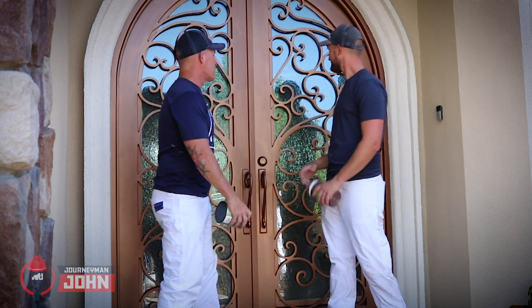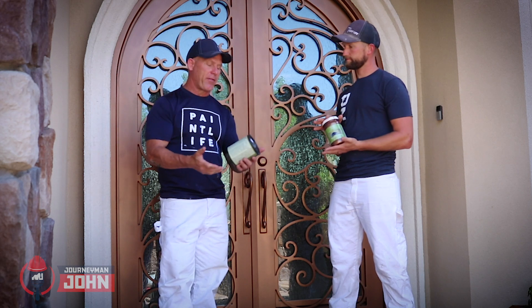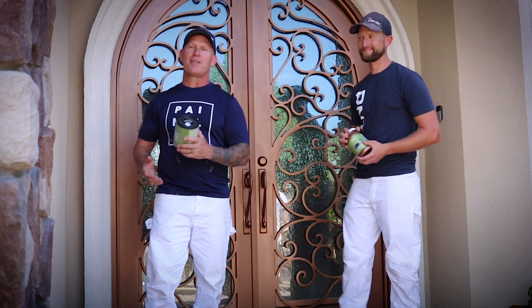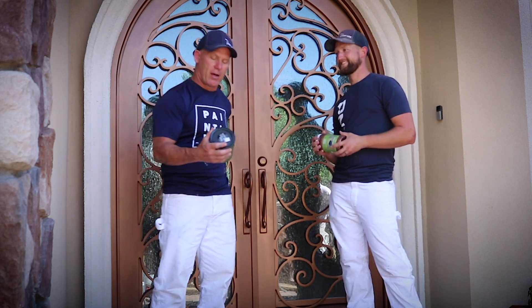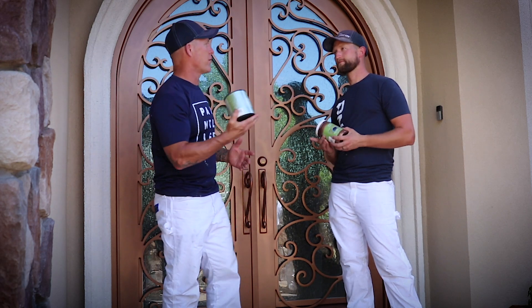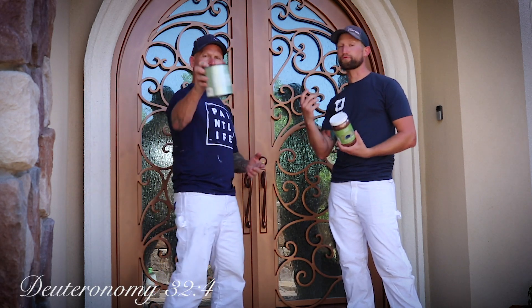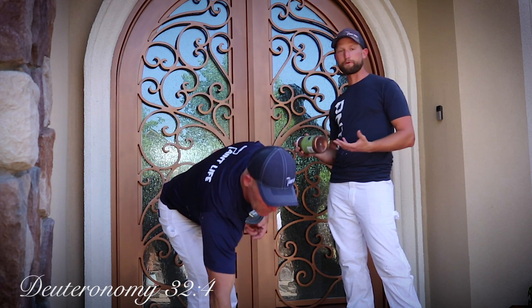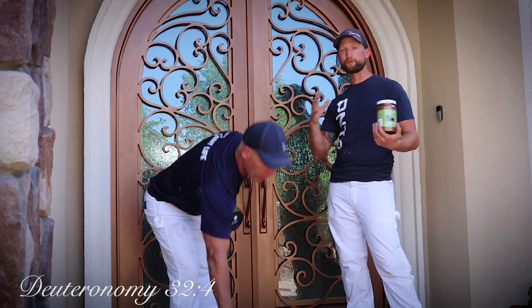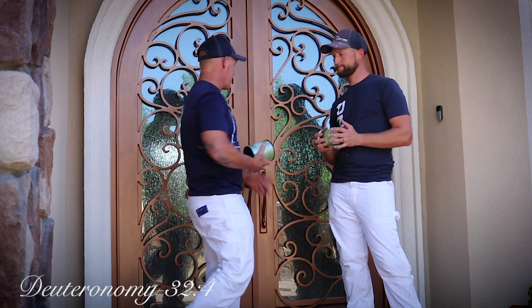The door is done and it looks really, really cool. We went through the process of spraying the metallic finish on there. We didn't show you the clear coat application because of a technical difficulty and a phone call — that's PaintLife for you. When you use this product you have to use their clear coat. They make a good argument for it: it's a really thick clear coat rated for upwards of 3,000 scrub cycles, and unlike other clear coats it isn't going to dull or take away the shimmer in the metallic finish.